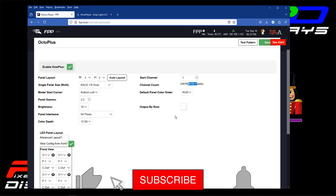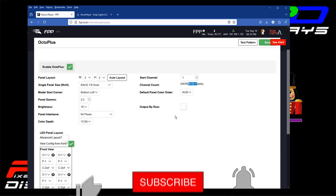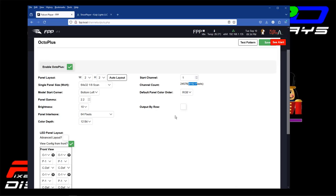Okay, go ahead. Specifically during COVID, a lot of panel makers went with very, very cheap components because that's what was available. I mean, give them credit for even finding components. What happened is that the components couldn't refresh fast enough when we were switching from row to row to row. So there's a couple of settings here that were specifically to slow things down and change the order of how we output data to deal with the crappy components that were common during the COVID problems.